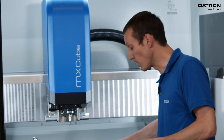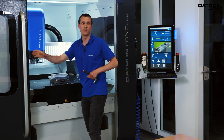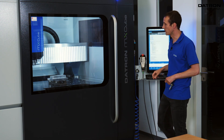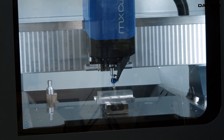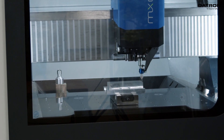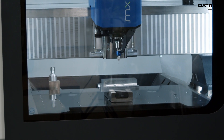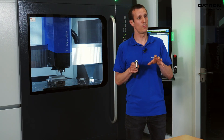Then our milling operations follow. Let's see how this works in the machine. I've taken the part out and put it back in, so it's not exactly at the same spot as before — just more or less — and I also used an end stop, but it's not as precise as before. We want the machine to locate it. I close the door and from the editor I execute the program. The tool comes to the center point assigned before, the probe folds down, it locates the center, detects the rotation from the front side, comes back, and then the milling starts. This is a pretty easy way to automate your processes and make sure all your parts are located exactly, even without a proper end stop.